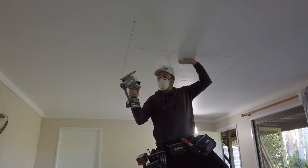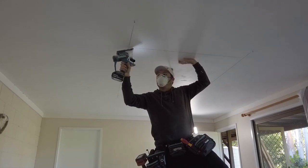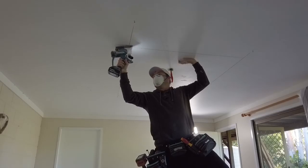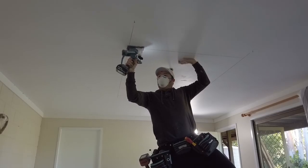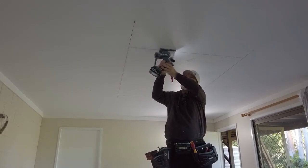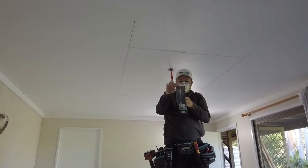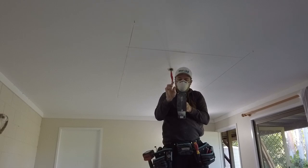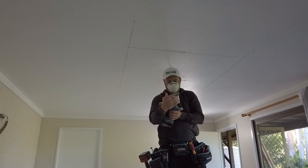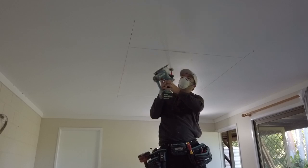When you're using these, have the edge like this, start the saw and then plunge into it. That's the way you get it going. It also has a nice little cutout V bit here. That's obviously your center, so it's really easy to see where you're going. And you can see that the blade finishes here. So you just bring it up to there, you line it up with these side bits, and that's how you know when to stop.